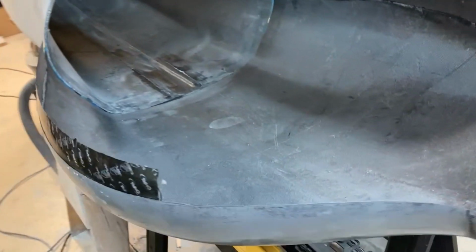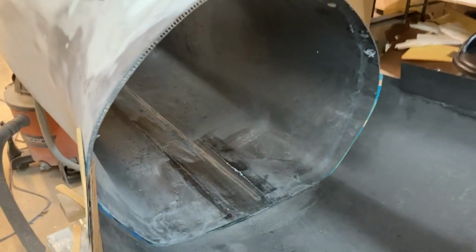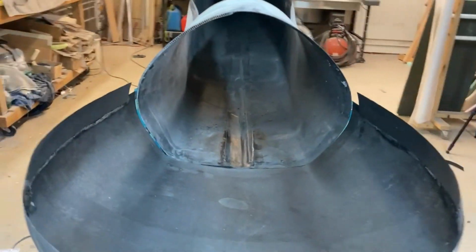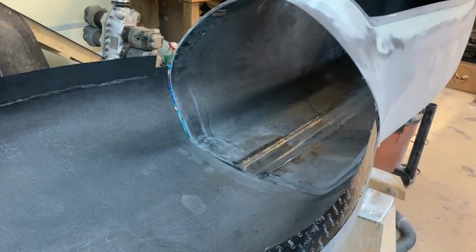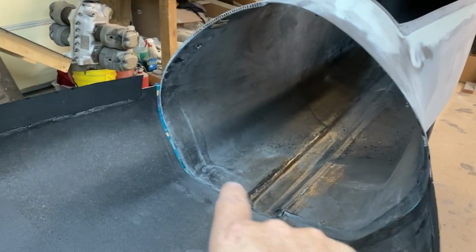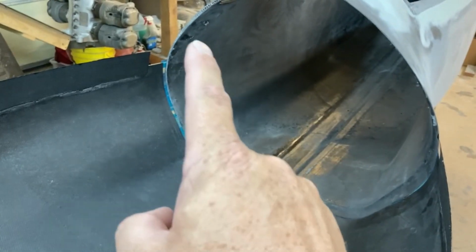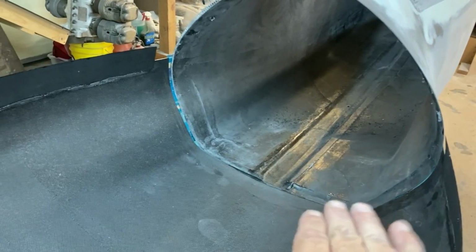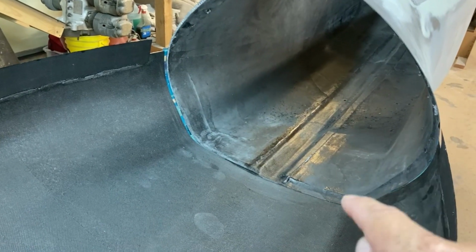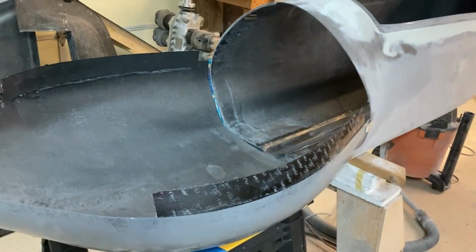So it's all good. Next step is I cut into the honeycomb here a little bit and extends around there. I did it to square off the fuselage because, as I mentioned before, my trim lines in the plug weren't exactly straight. So I took a little time and did that. So I'm gonna sand that back, and then I'll get the inside of the lip of the bottom of the fuselage there all ready to go. I'll put my 20 mil tape down here, and then I'll start with cabo and resin in there, and then probably 4 layers of glass here because I do expect to put nut plates here, and I want that relatively stiff. So that's the plan, keep going.